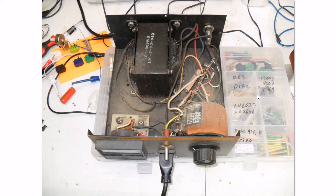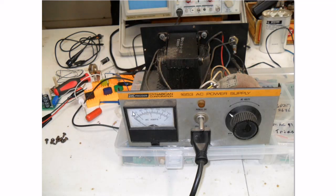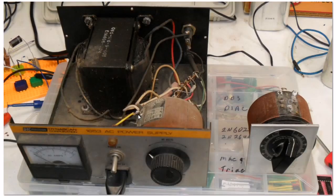Here's an inside look at the B&K box — isolation transformer, variable transformer — you can see what it looks like, plus a board to read current and voltage, an on/off switch, and so forth. This isolates you from the hot side of the power line. Here's a front panel view. I bought this thing in the early 1980s — it's decades old, but it works as good as the day I got it. I own two of these separately plus another complete variac unit with no isolation transformer.